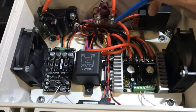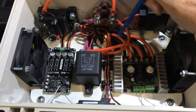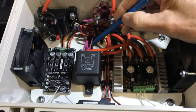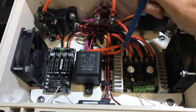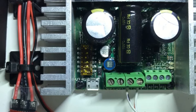Also needed in here is a 5-amp diode that goes from the positive to the positive on the battery for regenerative power, so you don't damage the motor controller when you're pushing the bot back and forth. In an effort to mitigate the erratic behavior of the Sabertooth controller when it goes into a low voltage situation where it has to reboot, I set dip switch 6 to off. What this does is it uses an internal map for the calibration and doesn't rely on the auto calibrate when it boots up. This also kills the failsafe on the Sabertooth.